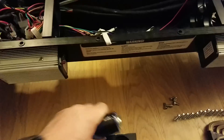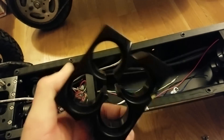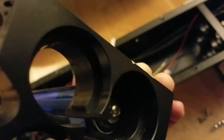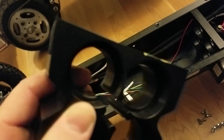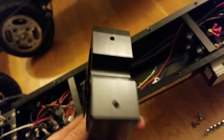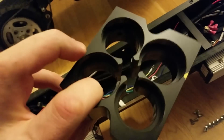After looking at the bracket for a little bit, I'd like to say that this bracket is super well engineered and designed — it's very solid, it's very light. When you put the cell in, each bracket holds each side. There's enough space calculated so they don't touch and short each other. And there's a groove right there — you can see how well it's machined. There's space in between where you can run the wires, connect the cells, and they really tie it together — it holds the body and the cells with extra support. Very, very smart.